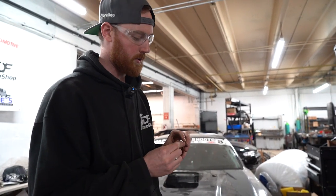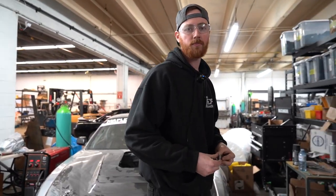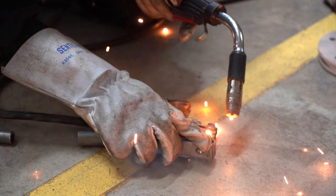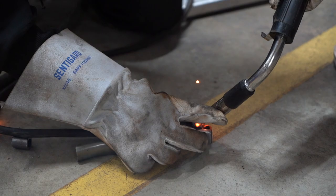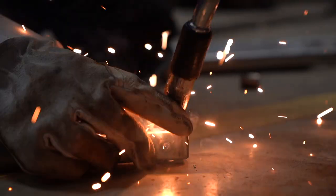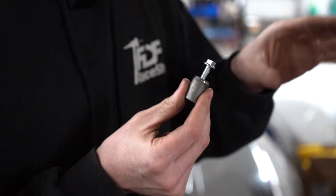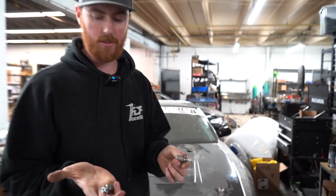You can do this a number of different ways — you could have a plate go out to it, drill and tap it, or weld the nut underneath it. But this is how I'm doing it because it looks kind of nice, it works, and it's fast. So these are what it looks like — just four tacks on a nut, faced on the lathe. Now I can use these to mount the front corners of my fenders in the spot that I want.